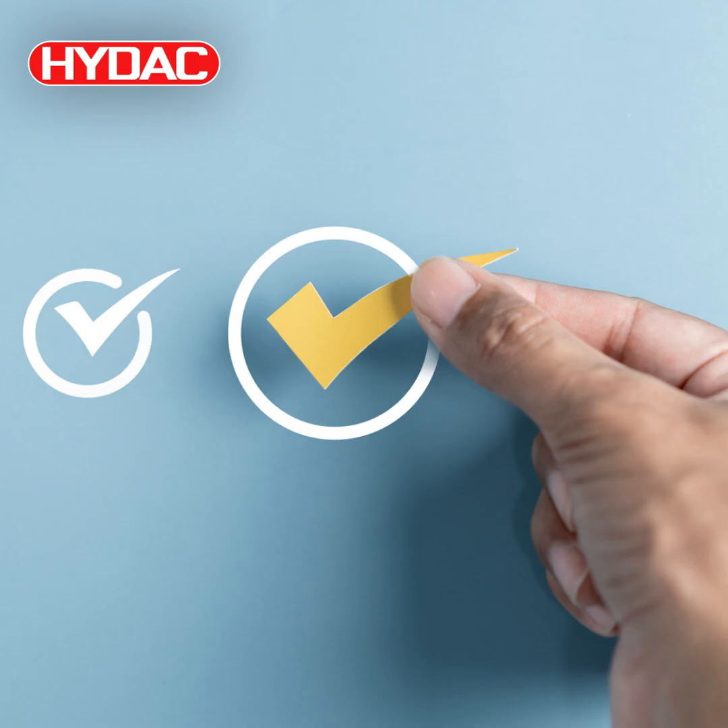So today we're going to cover AS 61439. In a few words, AS/NZS 61439 — it's a self-assessed design verification standard and the full title is AS/NZS 61439 Low Voltage Switchgear and Controlgear Assemblies. Basically, it's a design standard for designing low voltage switchgear and controlgear assemblies. Pretty much any electrical enclosure in the low voltage range that contains switchgear or controlgear falls under this standard.